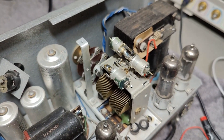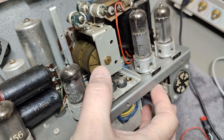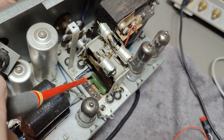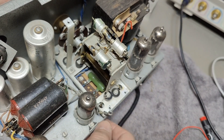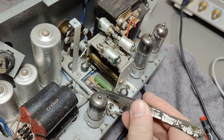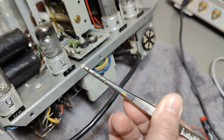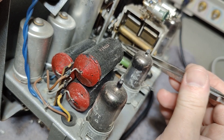There's a power resistor in here. They are heating up this entire enclosed area to remove moisture in order to make the oscillator accurate. Then I found a big piece of solder that was just hanging on the side - I touched it and it fell down onto that resistor. That is a potential quality issue. This solder piece didn't fall down in all those years from 1950-something - it was hanging on that piece of brass and I barely touched it and it fell.